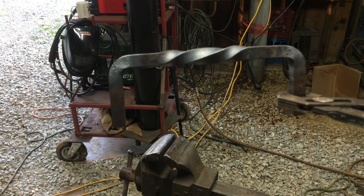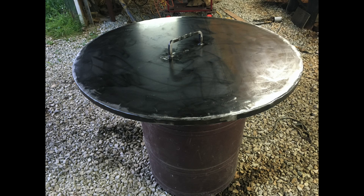The end product is something that looks like this. Here's the finished product — I ended up welding the outside seam where the flat bar one-inch trim meets the large-diameter circle of the cover. I welded that out, then ground it and made it nice and smooth. It's polished, there are no pinholes or anything in it — it's a nice seamless edge.